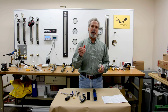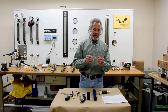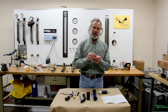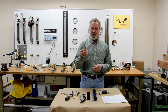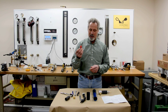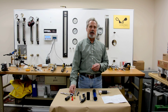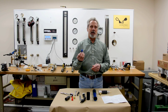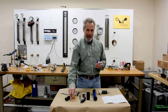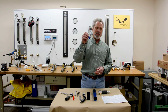At this point, if you're simply replacing the generator with the same size because the old generator is worn or dirty, you'll need to inspect the slots of the generator. If they are worn or dirty, clean it or discard it and replace it with a new one. Or if you want to increase the cooling capacity, purchase a new generator kit. I'm taking out the 15 CFM generator and replacing it with a 25 CFM generator, which is blue in color.